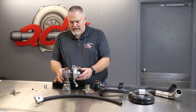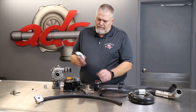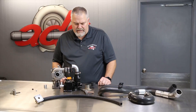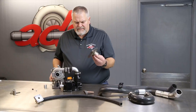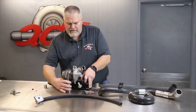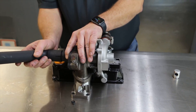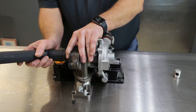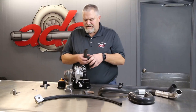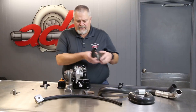We have the turbocharger drain flange, the pedestal, the aluminum elbow, and the reducing hose. On the exhaust outlet, we started with this temporary piece so we could run it while waiting for the water jet folks to get our other pieces made. This will bolt on to the back and that's where the exhaust pipe comes off and goes down the tractor in its stock location — we didn't go through the side shield or the hood. When running it without the side shields and hood, we used the little Johnny stock piece so we could still run it without smoking the radiator.